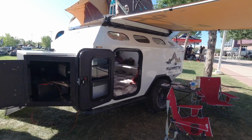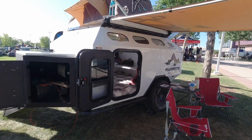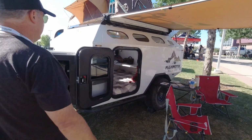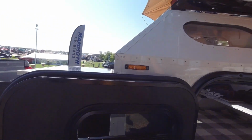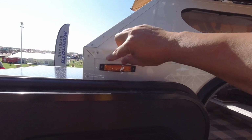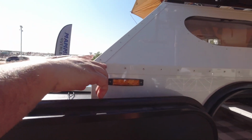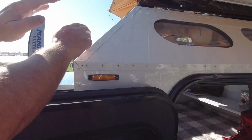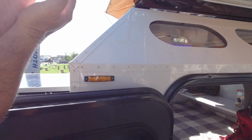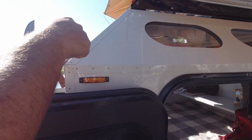It's sealed up super tight on the inside. If you look, it's a monocoque construction, like an aircraft. You can see how strong this is. Couldn't hurt it. So for the guys that don't know, talk about the engineering. How does that work? If water got in here, it's not going up inside here, right? It's not, because these are all overlapped, and then on the interior, the skins are wrapping around the piece. So even if water could get in here, it couldn't get into the cabin at all.